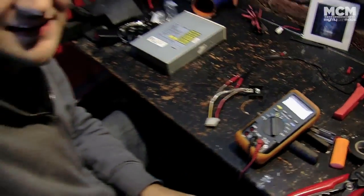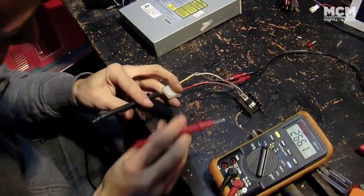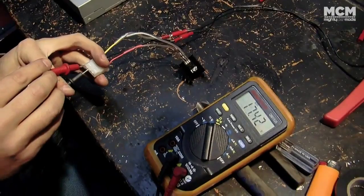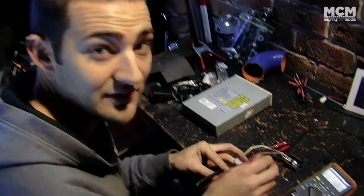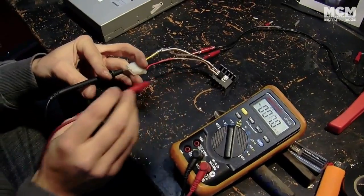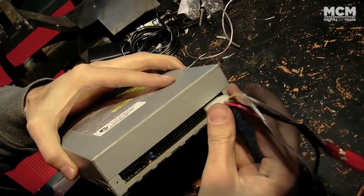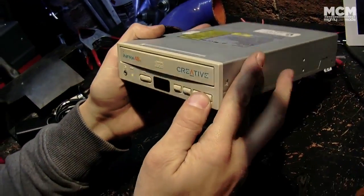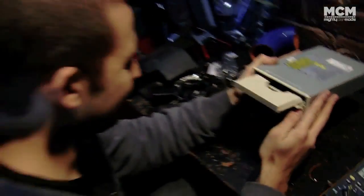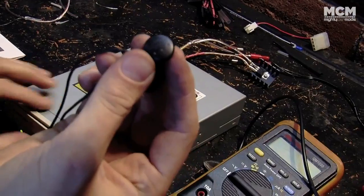Now it's often easier to test this stuff on the bench. If we've wired it up properly, we should be getting 12 volts on the yellow wire, which we are. And now our voltage regulator is shedding 7 volts and turning that into heat. So if we've done that right, we should be getting 5. It's blinking. Yeah, dude. That's awesome.